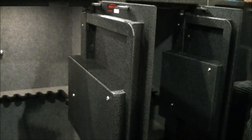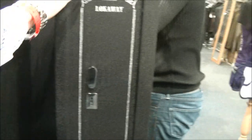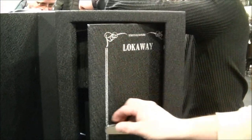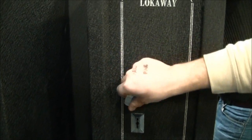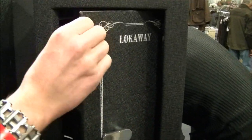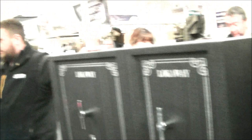You've got singles as well — that one on the right is the smallest one, a three to four gun cabinet. All of our safes are at 1500 high. There's a market for a slightly shorter safe, just for shotguns, which we don't have at the moment but it's something that can come about quite easily. At the moment this is our smallest one. The same principle is consistent across all the products — you've got a latch on the door so you can't pry it open. The entire door on both the leading edge side and the hinge side locks in and clamps. The advantage is there's not just one point of contact with the lock.